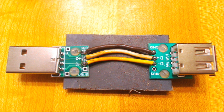I've soldered both breakout boards together using slightly oversized cable because I knew I'd be grabbing it by the cable and didn't want to spend my time replacing broken fine wires. Now, why the breakout connector? I can transfer programs back and forth with the unit still powered externally, and I can also do serial monitoring with the unit powered externally — which you cannot do with any of the other modes without this breakout board. As another positive feature, I'm not putting board power through my USB cable; I'm only putting a few milliamps of communication through the cable, so there's no risk of arcing or burning the contacts on either the Espressif board or my USB cable.